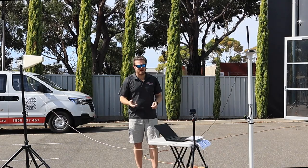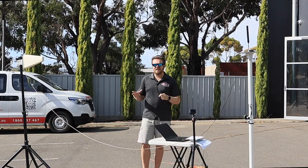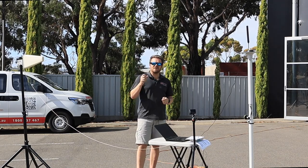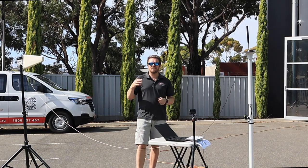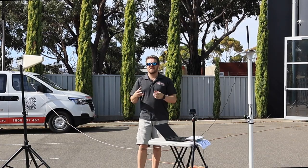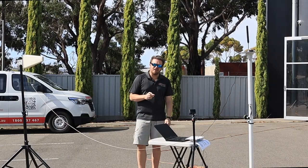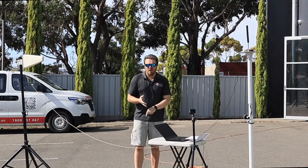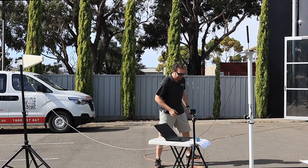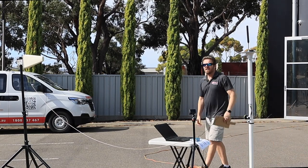Gain means more specific for a specific application. Today I'm going to do a demonstration of a Helium IoT quick upgrade — converting an omni antenna from a dipole into a 9dBi Yagi antenna. The principle I want to illustrate is that high gain is a feature, not an upgrade. That's the most important thing. This of course applies to WiFi, 4G, 5G, and it also applies to any application you have — and today, more so, it applies to Helium.